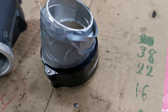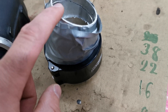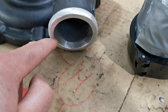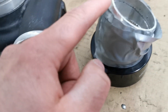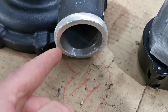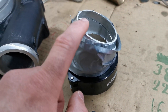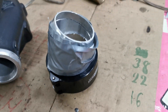Then I'll put a few spot welds. The most important one is the cone because I want to center that with the inner circumference. The outer one is not lining up with the outer one on the compressor cover, so I can't really look at it like I can with the other pieces. So I'll do this one to the compressor cover first and then do the other ones.